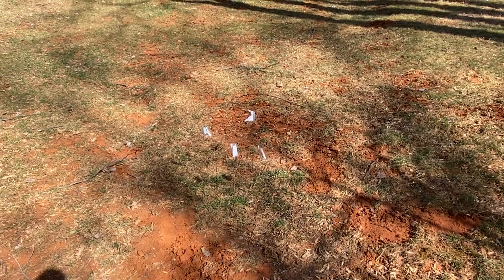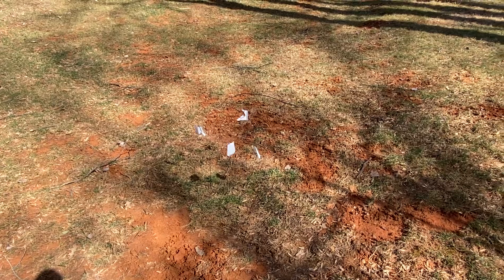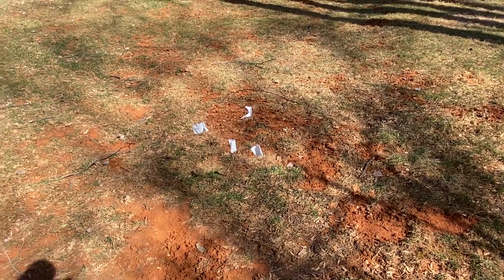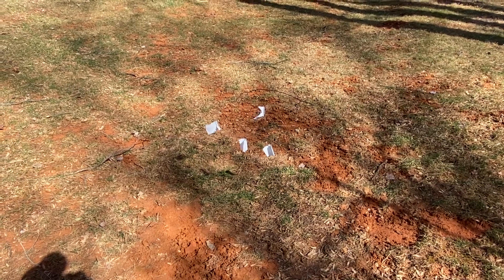The scum layer is going to be all your fats, hair, oil, greases, toilet paper, etc., and all the heavier debris will fall to the bottom as sludge. The goal of the back baffle is to prevent any of that floating material from getting into the outlet pipe.